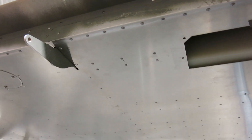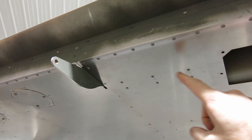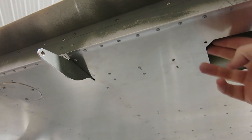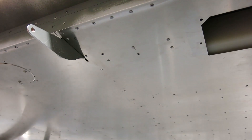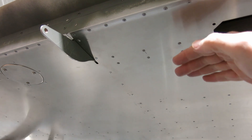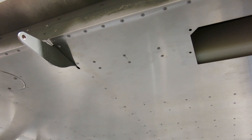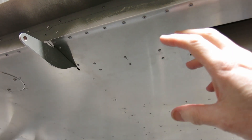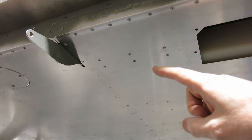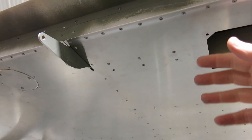Kind of the key thing is: measure these holes out first, drill them, then put the aft piece in there, mark it, pull it out, put the forward piece in there up against the tank, mark that one. Then you take it out, drill them out, clean it all up — drilled on a number 40, upsized to 1/8, and finished with a number 30 reamer. Took it all out, cleaned it, put it back in, and riveted it in.